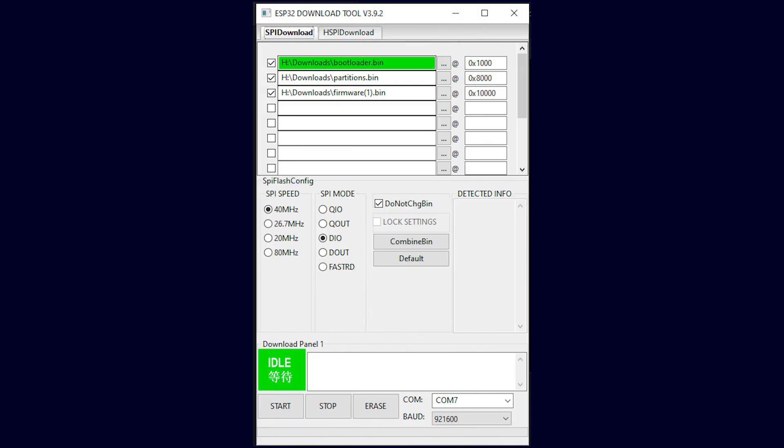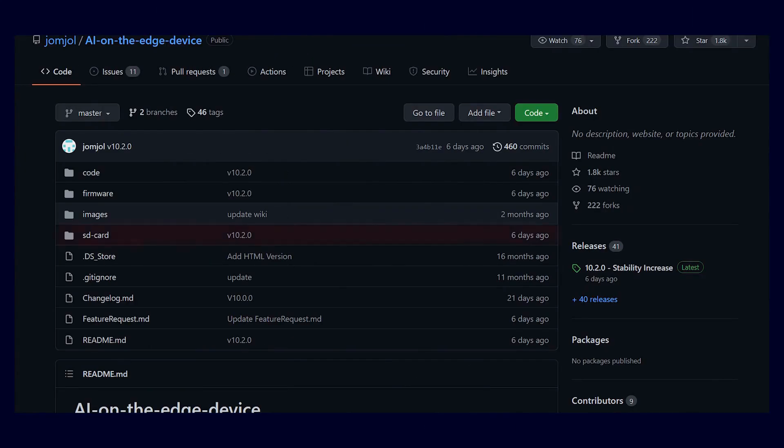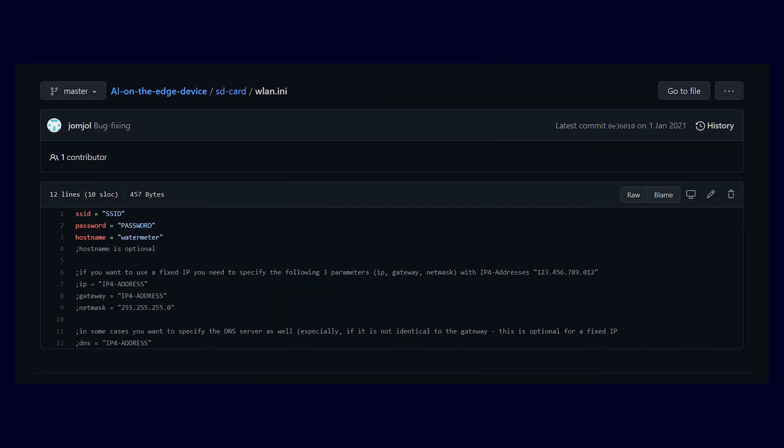We connect it to a Windows computer because that's just the easiest option. There is already software available that you can download, start, and then flash the three files onto the ESP. First we need to erase it once, and afterwards we can upload everything after a restart of the software. With that, we have established the basic framework. What is still missing is the SD card — it should not be too large, a maximum of 16GB. You need to copy the contents of the SD card folder, including the WiFi configuration. Once we have done that, connect the whole setup with 5V via USB or via the ground and 5V pins, and attach it to the water meter. I will also link a cool print template you can easily print yourself — it fits perfectly on the water meter and you can adjust the height with different units.